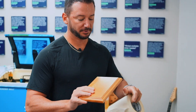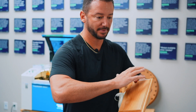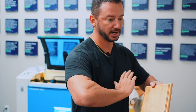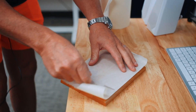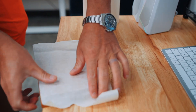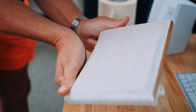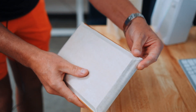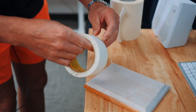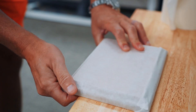I want to mask my plaque. I've got some real thick masking tape here and I'm going to put it all over the plaque so it protects the plaque while I'm engraving. I'm also going to leave the masking on while I paint, so I can spray over it and then paint the plaque. I'm going to use a squeegee to really get it down — if you don't do this, the masking can blow away after you engrave and the little pieces might blow away. I'm also going to cover the edges because I'll be using spray paint. All right, now I'm all masked up — let's head over to the laser machine!